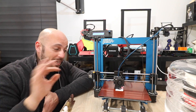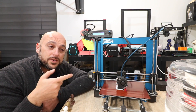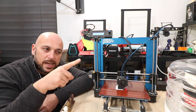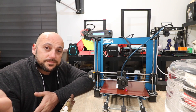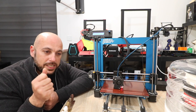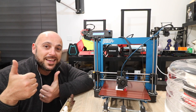There you have it — it's printing and it's working beautifully, and I'm happy! One thing to note: if you use the side guides there is a bit of resistance, but if you have a Bondtech extruder it'll do just fine, as the Pulse comes with a Bondtech extruder. If you don't have a Bondtech extruder and feel resistance, just skip the side guides and exit directly — very little resistance. That's it for me today, first project done! I'll leave links to the files in the video description. Make sure you like, comment, share, subscribe, and as always — happy making!